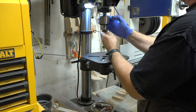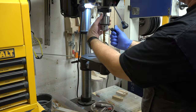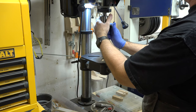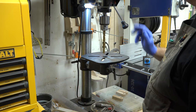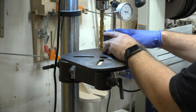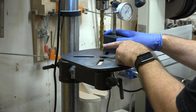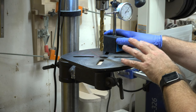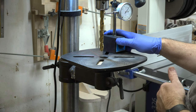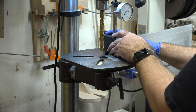We're going to manually crank up using the bevel gear until our gauge pin is just below the jaws of the drill press chuck. Once we get that in place we'll lock the table down, release the dial indicator to be safe, and then install a drill bit into our chuck. Remember to tighten all three holes in the chuck — make sure it's well tightened. If you have a steel rod that's even preferable, as you can test up and down the rod. The lower you get on the rod the more dramatic the results, but you can't do that with a drill bit because the cutting edge gets in the way.